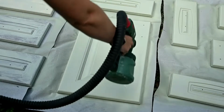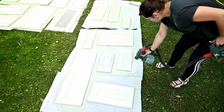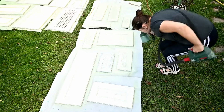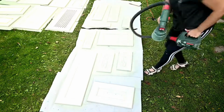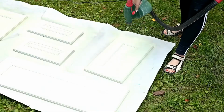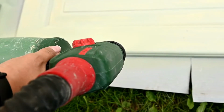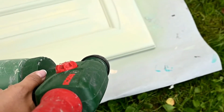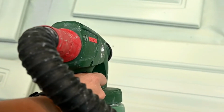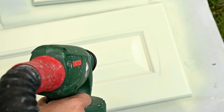And finally, the finishing coat. Here, when I hear people advise to seal chalk paints with wax for a kitchen, my head just stands on end. Yes, I agree that chalk paint under wax really looks very beautiful, but first, wax fully cures only after 2 or 3 weeks, and it is advisable not to use furniture during this time. And you're repainting an old kitchen where you live and cook every day. Can you leave it to sit and not touch the surfaces for 3 weeks? I think this is unrealistic, which means damage of the coating is more than possible.